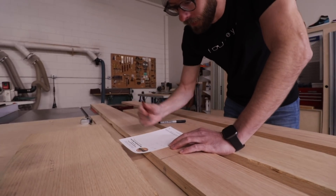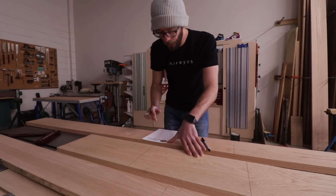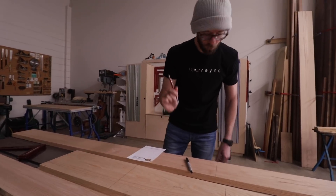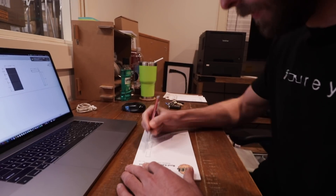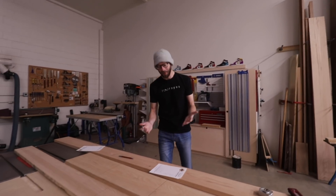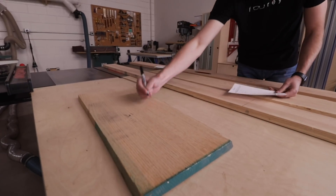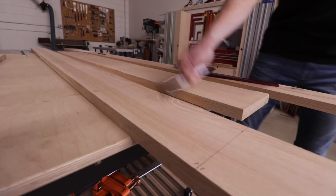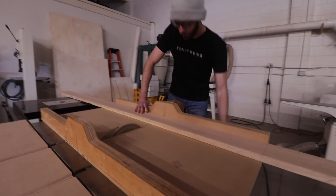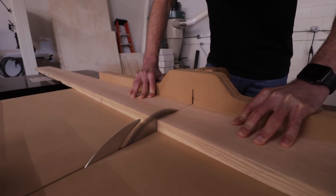I'm just going to check things off as I see them. So that's a drawer face right there - then there should be another one that's 11 and a quarter by seven and a quarter. Now that we're on the same page with our labeled pieces, we could actually get to work. Starting off by cross-cutting our pieces into some chunks that are overly long, and then ripping them into some chunks that are overly wide.